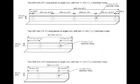There are several ways you can do this, depending on the tools you have available. The first option is to drill the holes in the angle iron right now. They should be 11mm or 7/16 of an inch in diameter. You will be drilling the holes in the corresponding metal sheets once the mold has been assembled. This option can sometimes make it hard to line up the holes properly.